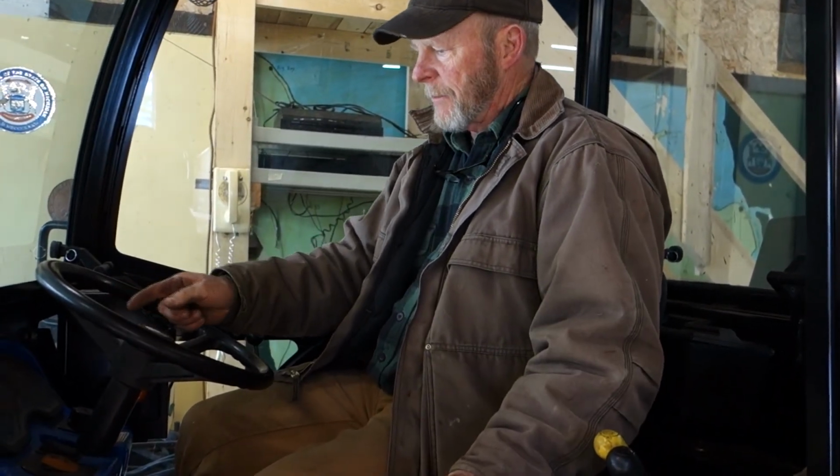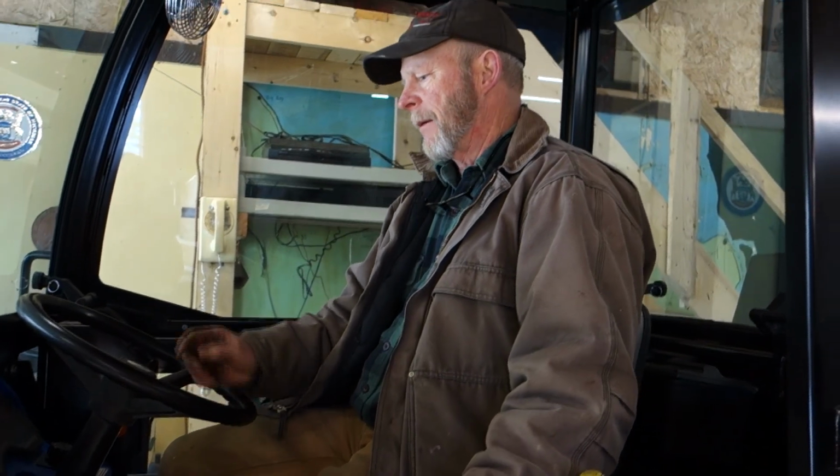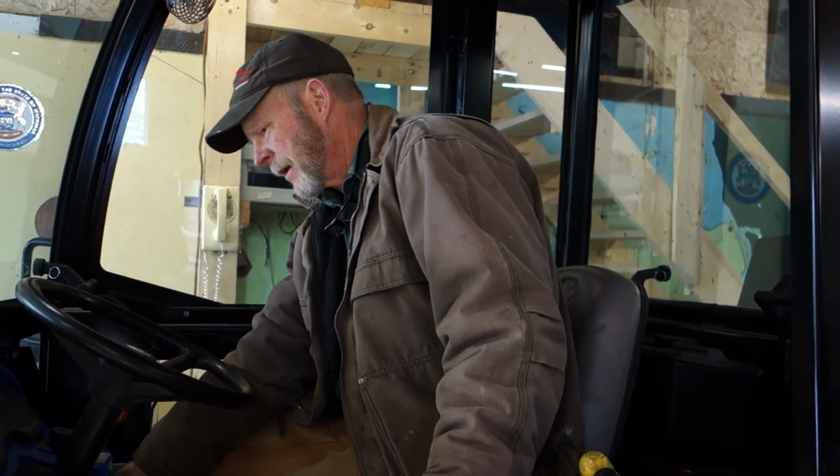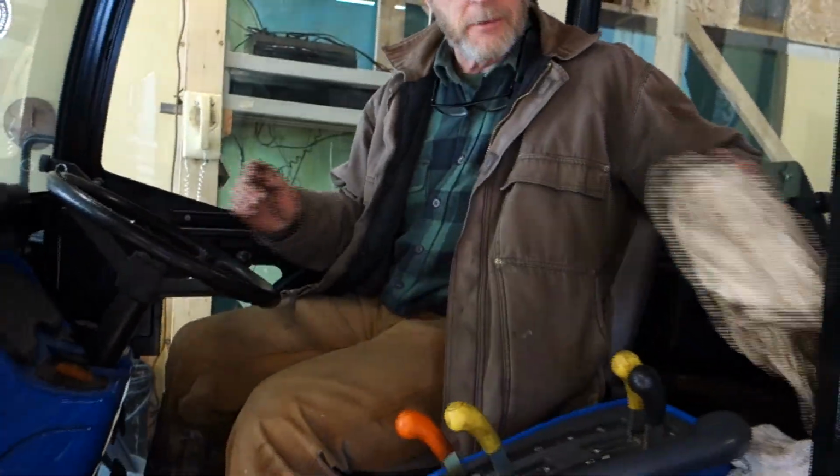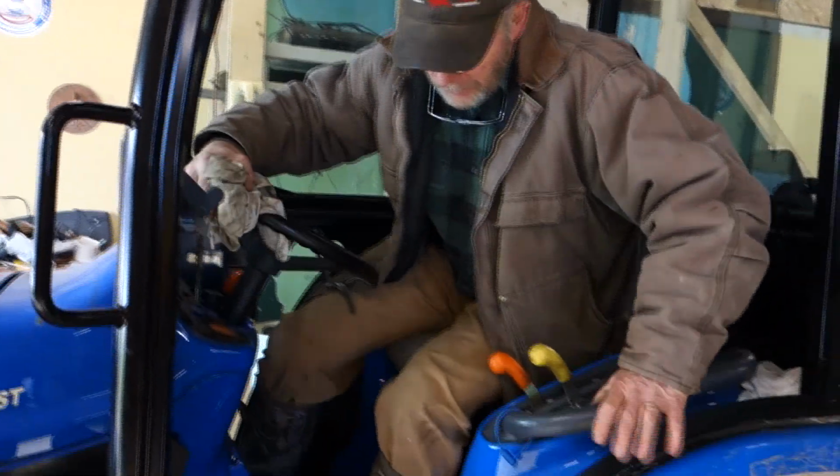When you're running a PTO and most things, be it the mower or this blower, then you're usually going to run this about 2,500 RPM. There's a gear symbol on there. So you run it at high RPMs. Keep that in mind. Okay. Put that in your pocket for a rainy day, eh? Do that. Damn right. Right where it belongs.